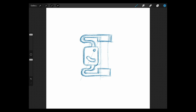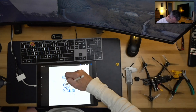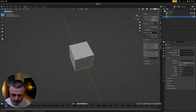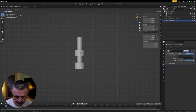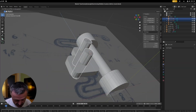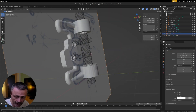However, this gyro is super sensitive, and while I tried different configurations on the quad — my 4-inch quad — it is flying really superb. Due to the support of the on-screen display in the goggles, I had to update to Betaflight 4.3. But with an F7 processor, it's actually quite easy to set up all the filtering because almost everything is dynamic. So the flight controller does all the filter tuning for you, which is excellent. It flies really smoothly, really nice.